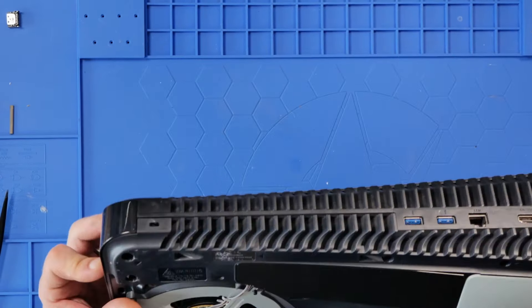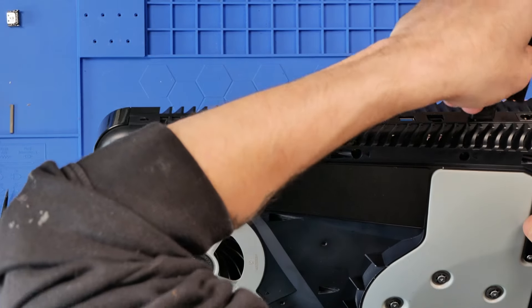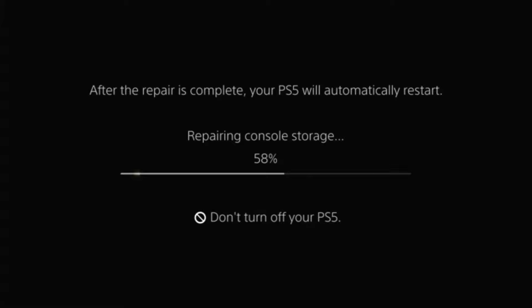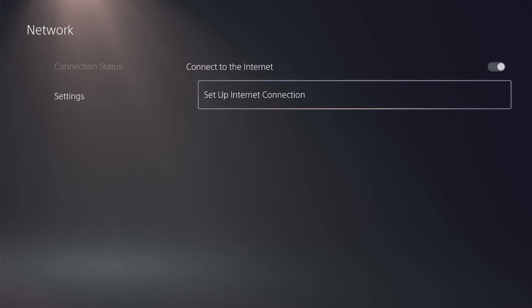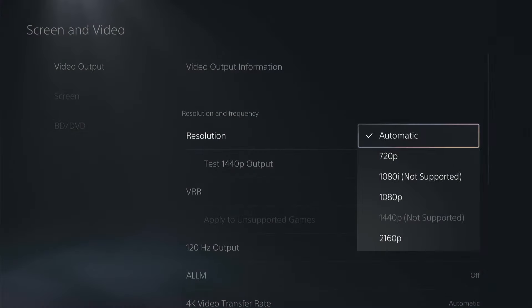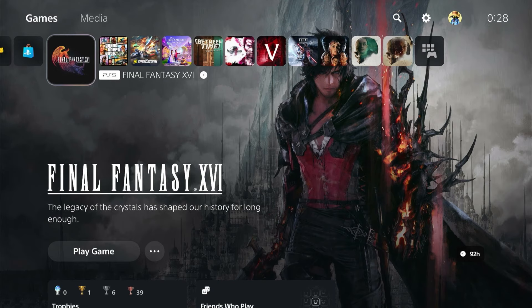Now we're back together to a point where we can fully test. I'll get my HDMI — it's a nice solid connection — get my power, and wait for that to go to a white light. It's on a white light. We have a display — just sync up a controller. There we go, just wait for it to run through. I don't want to connect to the internet because I don't want to update if the customer doesn't want that. We'll check video output — resolution at 2160p. That's great. Set that back to automatic. That repair seems to be complete.